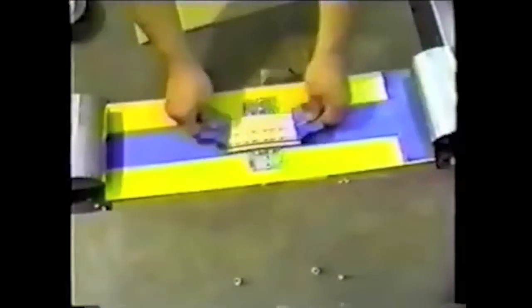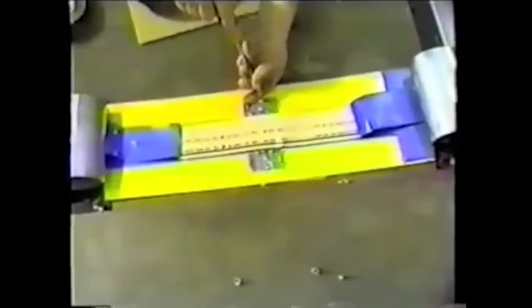Fold the top shield back approximately 9 inches on both sides of the floor fitting, exposing the top protective blue vinyl covering on the cable. Temporarily, tape the top shield back out of the way. Pull back the top protective blue vinyl covering on both sides of the floor fitting approximately 9 inches. Remove the floor fitting base plate and set it aside. Floor fittings can be reused.